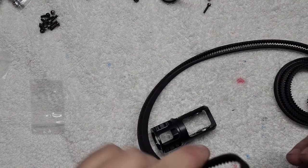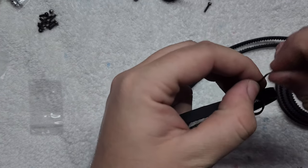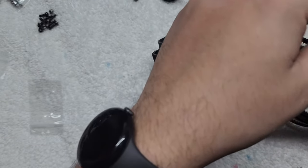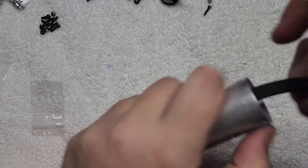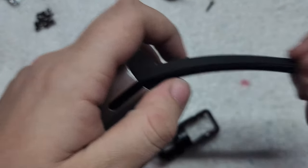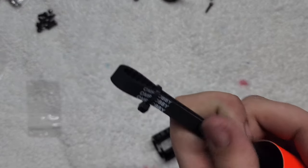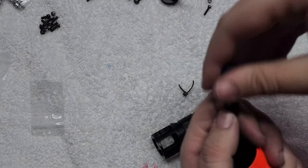Alright, so here's my little trick to getting belts in down through the boom. Take a zip tie, do not, and I mean do not, crank it down all the way, because you will destroy the belt. But you can do it just enough that it fits through the boom, then you can feed it through without any problems. I used to do the thing where you attach it to the tail push rod, but this is way easier. Then you can just cut the zip tie afterwards, just like that,